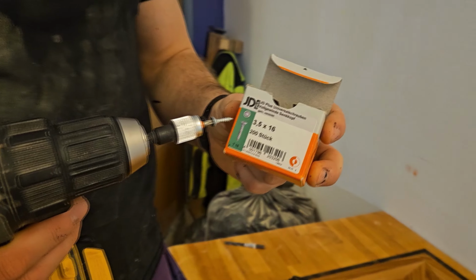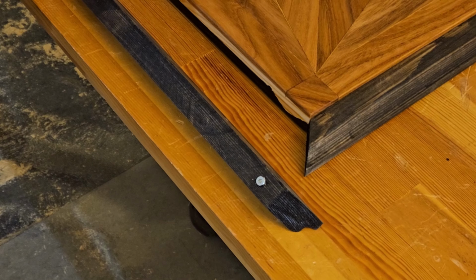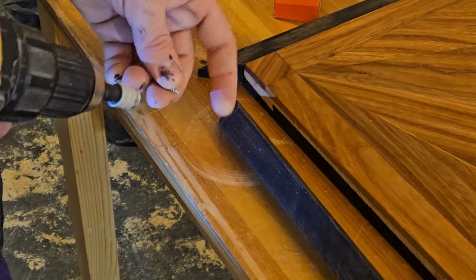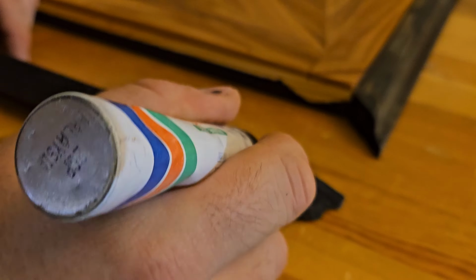After painting the frames, I use the same method I used earlier with the dowels. I mark the screws with my pen, and then I pressed them towards the platform. This left an imprint where I could then drill accurately.